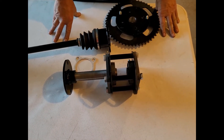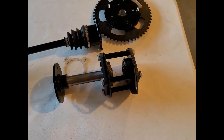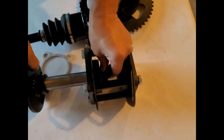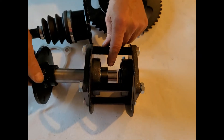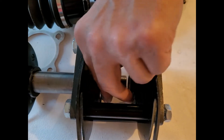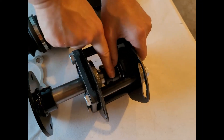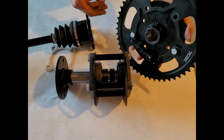These are self-centering bearings with locking collars. As we assemble this we need to put the locking collars in — they're non-concentric, so they're thinner on one side and fatter on the other, and they fit on the bearing. Once you put it together you spin it until it locks the hub, then hit it with a chisel right there to tighten it. To take it off you hit it the other way. We'll have two of these on there to lock the shaft onto the bearings.